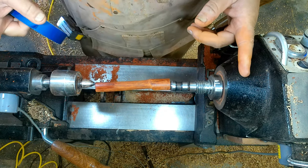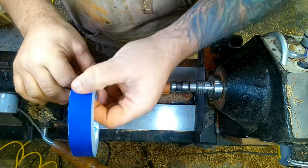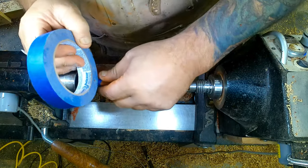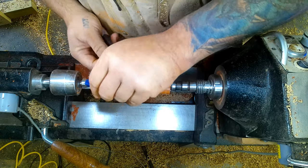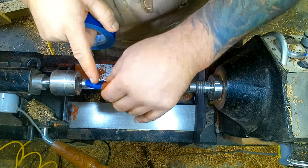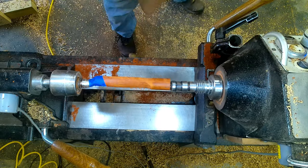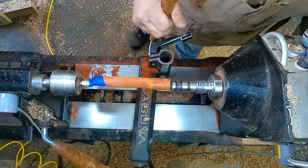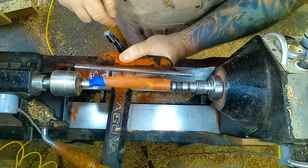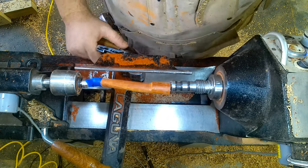You could do a whole length and then just cut out a section in the middle. That's another practical way to do this as long as you understand the diameters of your pen. I know I'm going to cut some of this off — I'm cutting over here, and this is the right facet. Face shield for this — this is sketchy as can be. I highly recommend you wear your face shield. Most of the time when you're turning spindle a face shield is a little bit extra, but this time, yeah, wear your face shield.